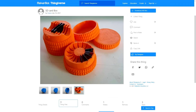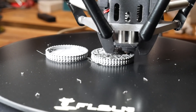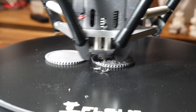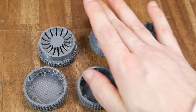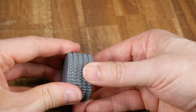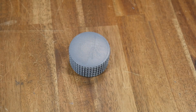To test printing with PETG, I selected an SD card box, and on the fast preset the infill was an absolute disaster, which unsurprisingly had a negative effect on the final printed object. I experimented with different types of infill as well as speeds and flow rates without much success, but what really fixed it was printing it again on the quality preset. The slower feed rate seemed to suit the material a lot better. This is a nice design, and closes with a satisfying click.